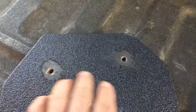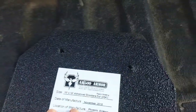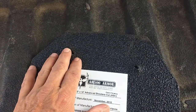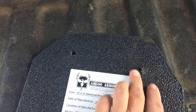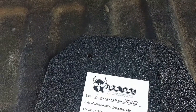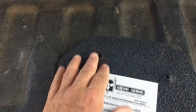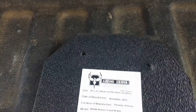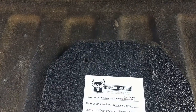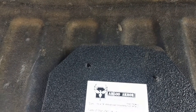As you can see, we've got our two holes that we punched in — they go clean through. What I'm going to do is try to knock the anti-spalling off with my grinder, try to smooth out the plate where it's peeled up, and then I've got a couple of carriage bolts I'm going to try to slide through there and sandwich between a nut and washer, and then they'll give me a stud.